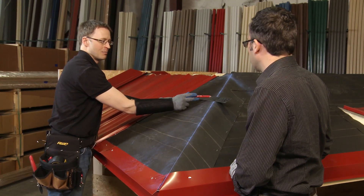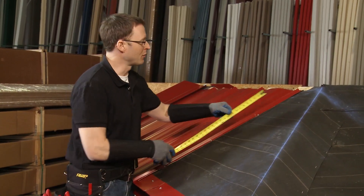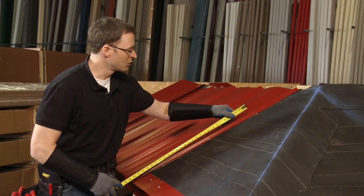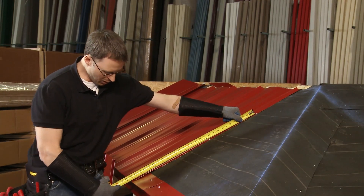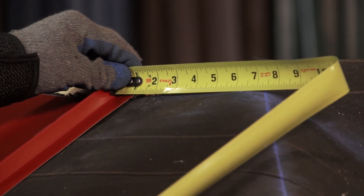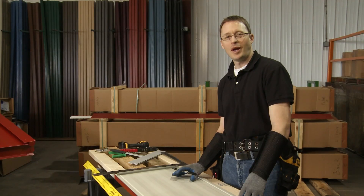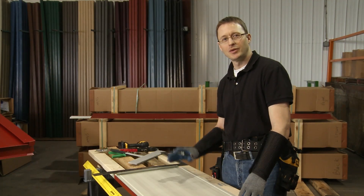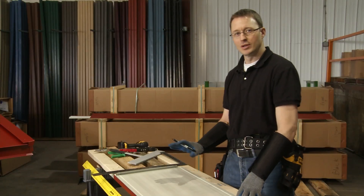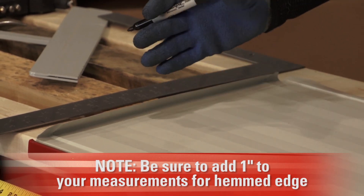I'm going to take the long measurement — measuring from the top of the panel down to the eave — which is 41 and an eighth inches. The next measurement, the short on the angle from the line we just made, is 29 and 3 eighths. The distance from the top to the hip is 7 and a quarter inches. I'm going to take those three measurements, transfer them to the back of a panel, and cut it. I also want to point out something important: at the eave of this panel there's a one-inch clip that clips onto the drip edge.